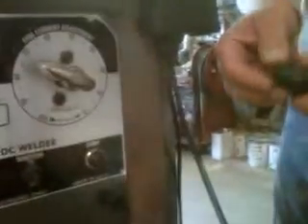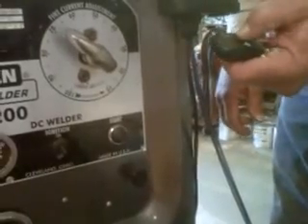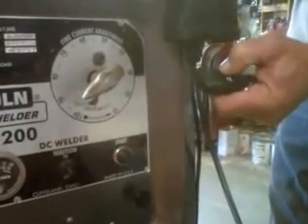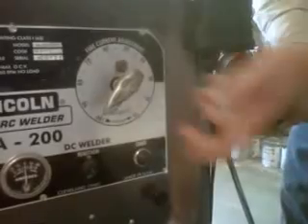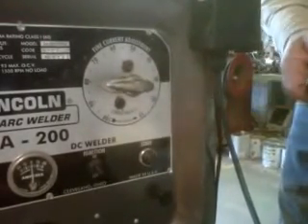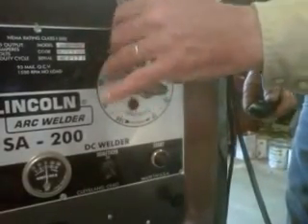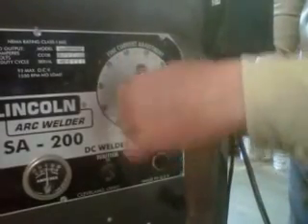You can test it — take your key fob and test it. Run it all the way to the stop and make sure the slip clutch isn't too tight. It should be slipping — that's about right. Take it all the way around, and if it slips at any time just take this lock nut and tighten it up a little bit. Or if it's too tight, loosen it. You want it to slip where you can still adjust it by hand.